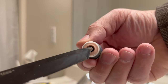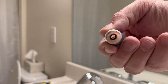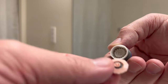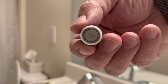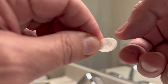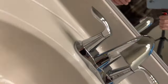See how that just popped off? There's the low-flow device right there, and there's a bunch of crud in it. These just flick out — see how easy that is? That piece comes right out, and that's what's inside. Here's the piece that flipped off the top — it's just a plastic filter.